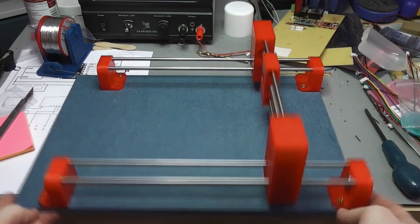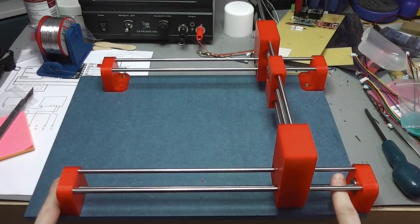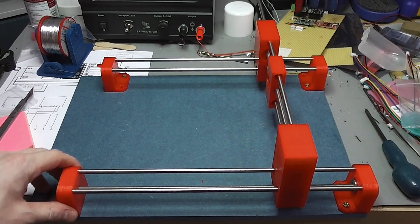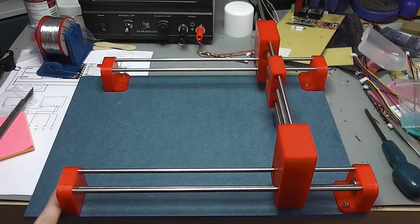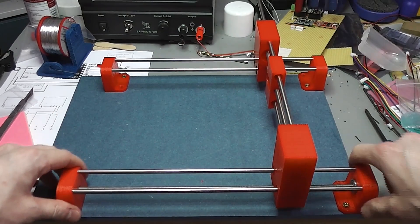I've also attached, at least on this side, a hole or bearing mount for the drive shaft. The mounting is on this side as well so it doesn't take up any space that way around, and I've got two sets, front and back. I've had a few problems printing these edge pieces - one did snap off when I pulled it out of the printer. I've tweaked the printing parameters: previously 0.3mm layer height and 20% infill, now back to 0.2mm and 30% infill for a bit more density. I've also chamfered the edge more. So the latest design is looking promising.